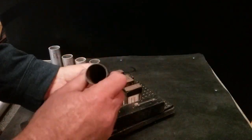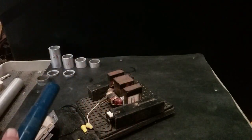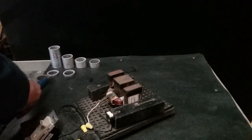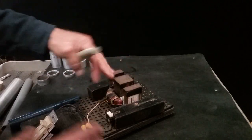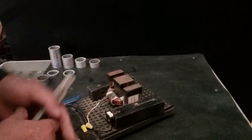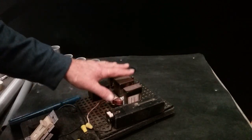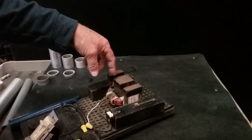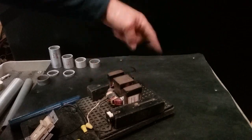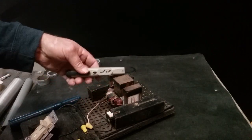I have this steel pipe — I'll show you with a magnet, the magnet sticks to it so it's steel, and so is this one, a little bit longer. This is the difference between a regular magnetic field of a magnet and an electromagnetic field. We're going to work with this electromagnetic field. We know that it changes direction of rotation around this coil — the main primary coil — 60 times a second, so 30 times going one way and 30 times the other.